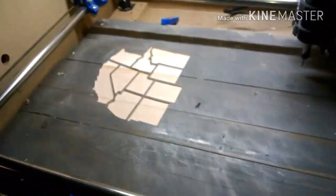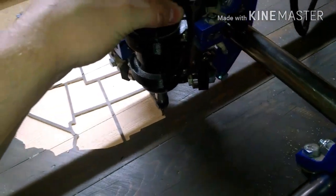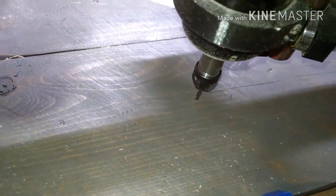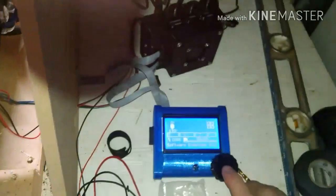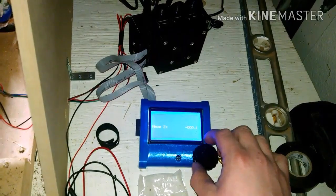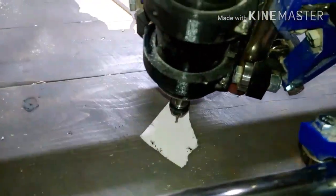What I'm going to do here — it's going to be a little bit difficult with just one free hand — but I've kind of just very inconspicuously marked where I'm taking my home position off of right there. I used the touch plate for a while, but I was having so many issues with interference and it being triggered when it wasn't supposed to be triggered, so I just gave up on it. So I'm just doing it the old-fashioned way. I'm bringing it in, going to drop it down close to the material.